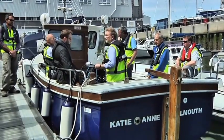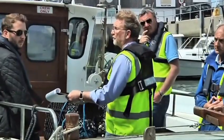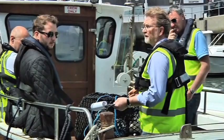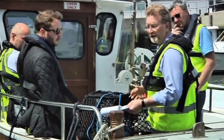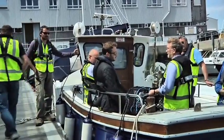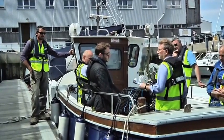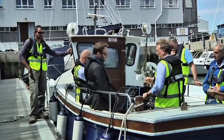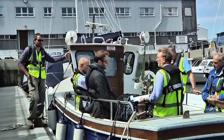The reason we're measuring from the transom to the position that we measured the freeboard height at is for future checking of the vessel, so that if you come back to it on a future occasion, for example at the 5-year renewal, and you're trying to do a quick check of the freeboard, then you know that you're checking length for length, because you're going to be checking at the same sort of position, because you've got this piece of paper that tells you where the last measurement was. Otherwise, it might not make too much difference on this boat if you went a foot forward or aft, but on other boats it could perhaps be a big difference.